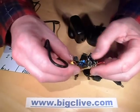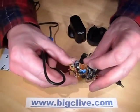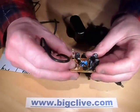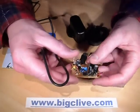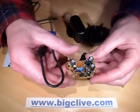It's rated at putting out 5.5 volts. I'm not 100% sure why USB chargers put out 5.5 volts — it doesn't seem a good idea to me. The transformer inside has no active circuitry in the sense of a chip or anything like that. It really is just a simple free-running switch mode type power supply based on discrete components.